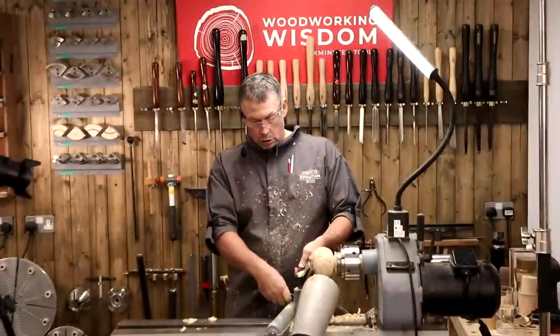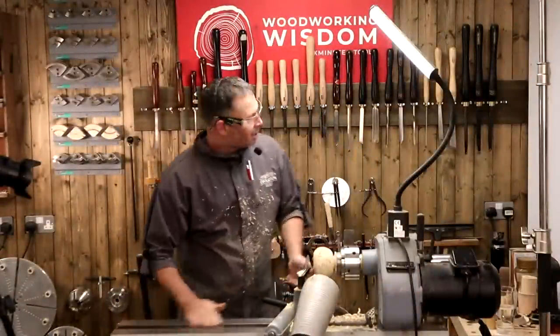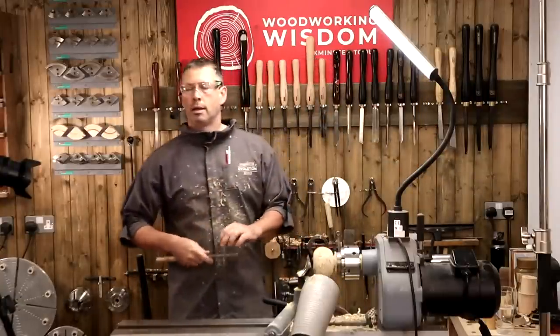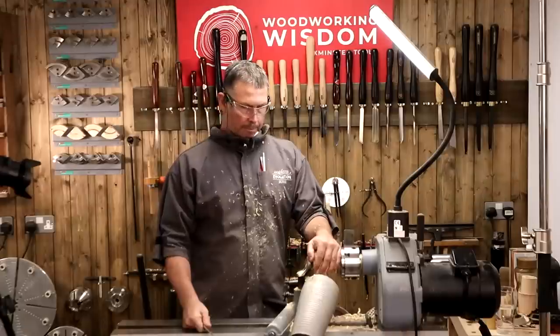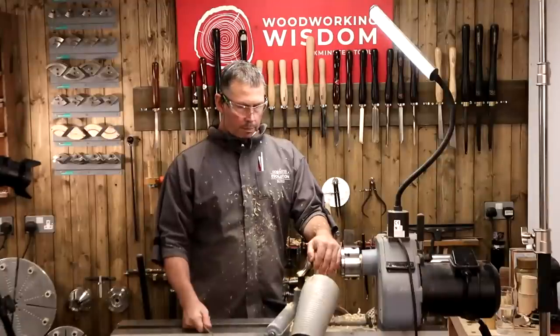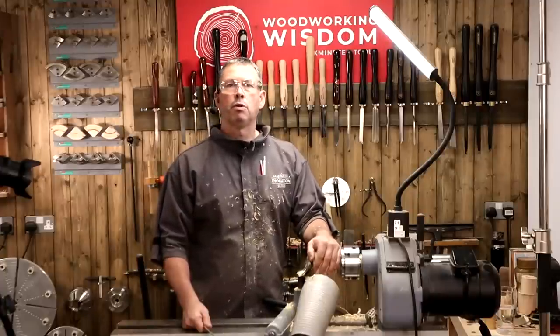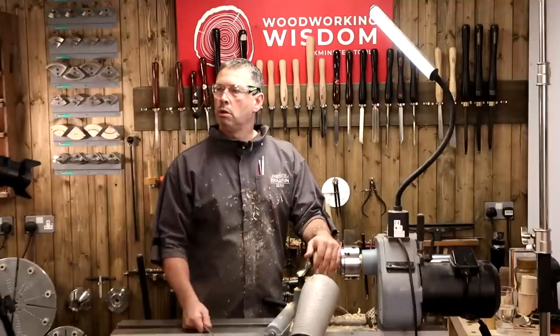Yeah, Ben, questions. So, yeah, we had a few questions in. First one is from Dances with Aardvarks. I'm not sure we're going to know this, but do you know if the Axminster Junior Chuck body is fully hardened? He wants to drill a few holes in it and wants to know what he's up against. The bodies won't be hardened. It's the mechanism that is. The scroll is the hardened bit. The pinions are the hardened bit. So those wearing bits, but the body will not be hardened, no.